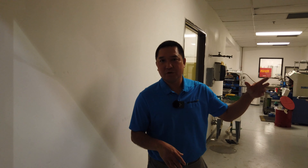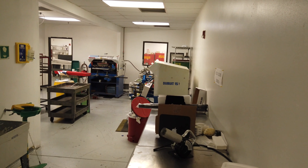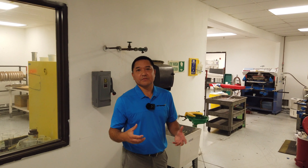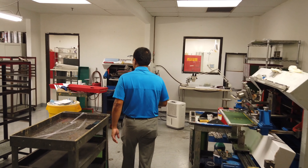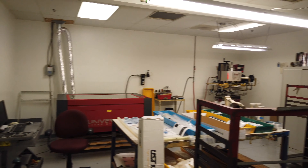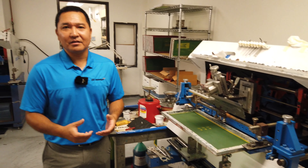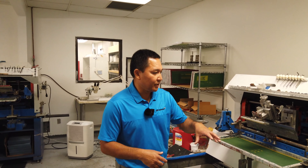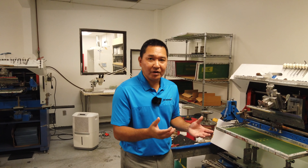Once the golf shaft is rolled and ready for finishing, we come in here into our paint room. The goal is to produce a finished product for OEM, a finished product for tour, or finished custom products for customers. We have a variety of methods. The simplest form — if you look at this right here — is a silk screen. It's like making a t-shirt really. We can take intricate designs, put them onto the screen, and then apply paint in whatever color or combination we want. If a customer wants five different colors, we can do it, but with five colors it takes a lot longer because each color goes in the oven to cure before the next print.